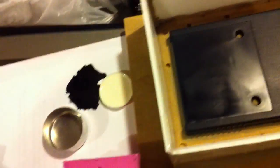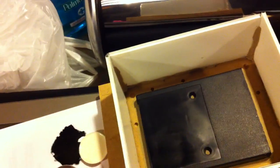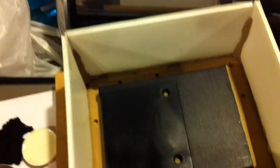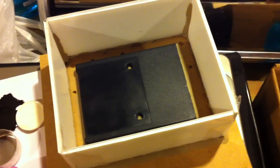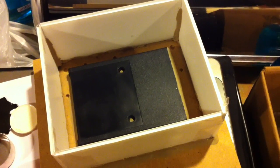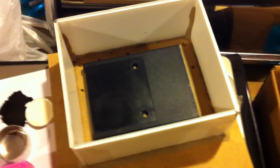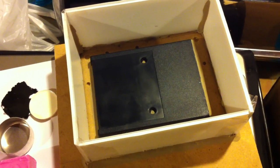For this plug mould I've been very careful to completely seal up the interior space, so I'll get the inverted cavity that I can pour resin into. And the other side, when I turn it over, will pick up all the surface detail — that's the plug side, which gets smooshed in to squish all the resin out and hopefully give me a nice cool shape. So yeah, that's the latest project. It's a pretty fiddly way of making these things, but I think I'll be able to get a few quite nice quality cases out of it. It's certainly not cost effective for large scale production, but I'm having a lot of fun with it and I just want to see how good a result I can get for my own use. Thanks for watching.